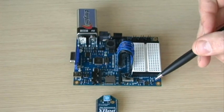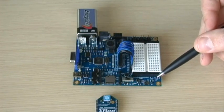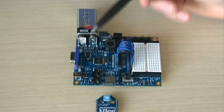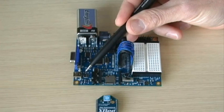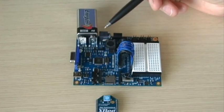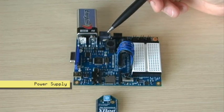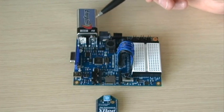In the lower right-hand corner, there are three 10-bit A to D channels and two variable-bit D to A's with voltage level indicator lights. On the far left is the USB programming port with transmit and receive LEDs, VGA, and a mechanically and electrically interlocked power supply.